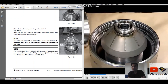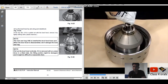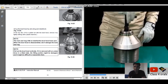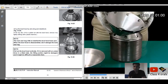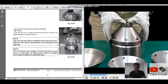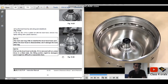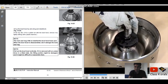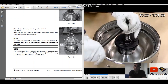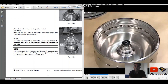Now, the distributor, the disc stack, and the top disc are visible. We have to connect it with the screw handle. After that, we have to clean the individual discs and arrange them in the proper order in the sequence they were opened. Now we have to open the operating slide — using the jack, we connect the four screws, and the operating slide is taken out.